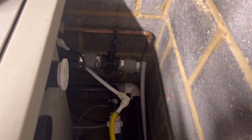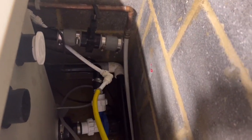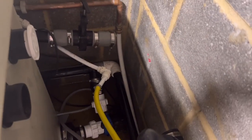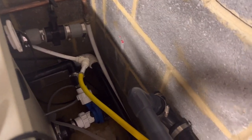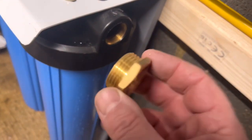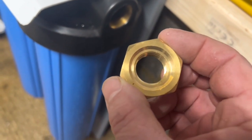I've got that dripping away. Those are Valtieri gate valves — they're absolutely rubbish, but it's enough to stop the major water coming back from the ponds. I don't mind if it's not a perfect fit. Anyway, that's done. So out of the T, up into there, into the jumbo. And then I've removed the pipe that was in there earlier. Now I've got the inch to 15mm male fitting.